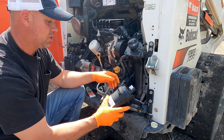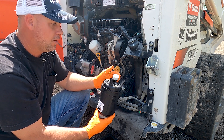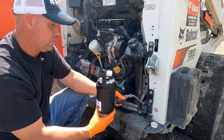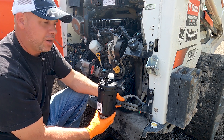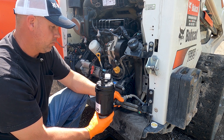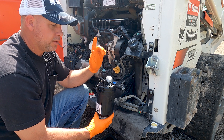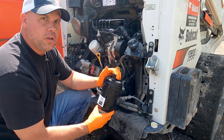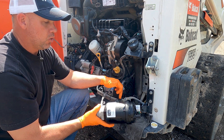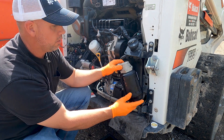Another option — this doesn't work on all machines — but we can turn the filter upside down, back off our water drain fitting, and use our primer bulb to push the air out from the bottom. Some machines it doesn't work because there's not enough line and you kind of pinch the line, so you will have to take that bleeder screw out of the top. Now that filter is full of fuel, no air left in it. And I want to mention — do not pre-fill this filter. It's very important because it is just too easy to get contamination in the filter. We always want to screw it onto the head and use our primer bulb to push fuel through to make sure that no dirty fuel gets into our fuel pump itself. Very important.